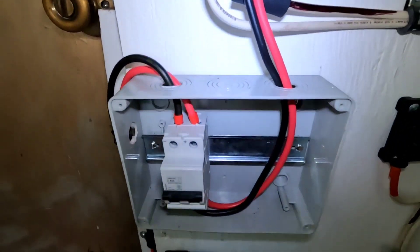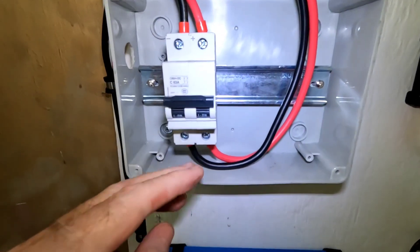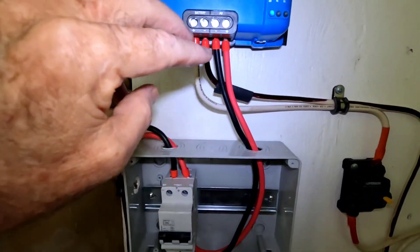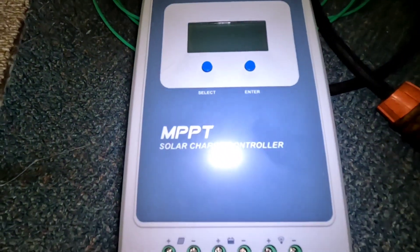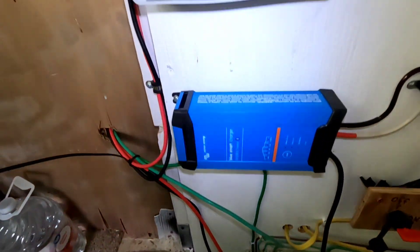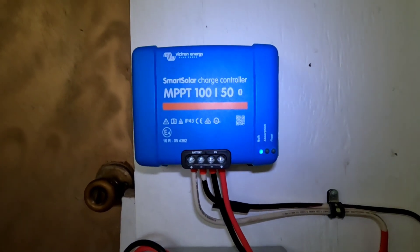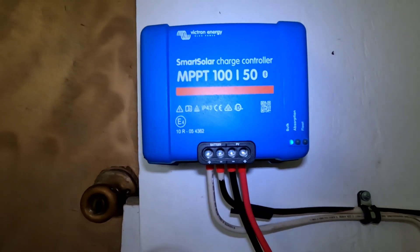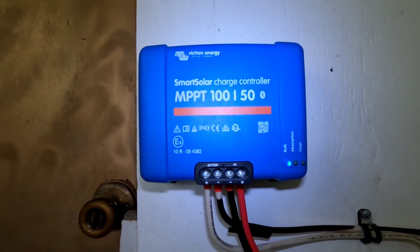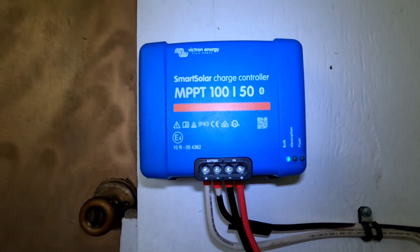Here's that top string panel isolator for 500 watts. I was testing the voltage coming in and coming out of here, and then on the EP Ever I was testing it up on the inputs as well. I could never get the proper voltage and never saw a single amp coming into the system. I went out to the string of panels and tested those - I'd see about 60 volts, give or take. I just naturally assumed the array was fine even though the voltage varied somewhat.